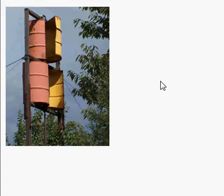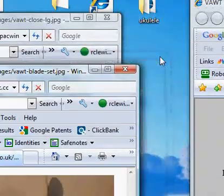Now most people call those Savonius, but a Savonius is typically just like a cylinder cut in half, like you see in this picture. They're just like a barrel — cut the barrel in half and slide the two halves apart. It catches the wind in one direction only. It's not very efficient, maybe 15% efficient. A good bit of torque, but very low RPM — 15 or so percent efficient.